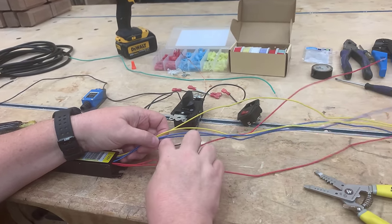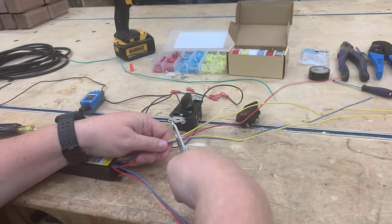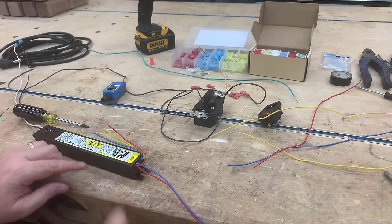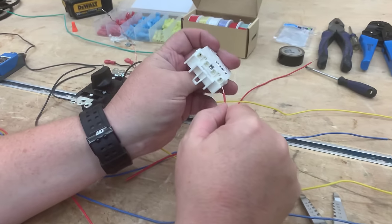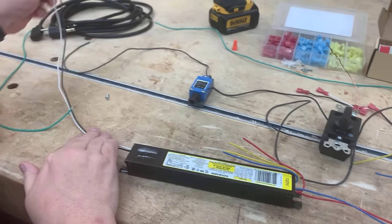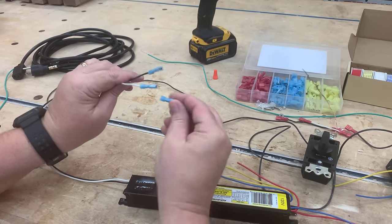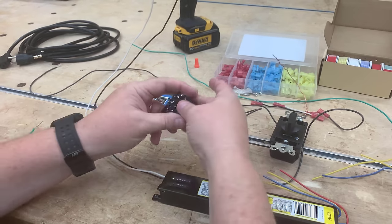Starting the wiring: on one side of the ballast, pull off one red wire and one blue wire — those are the two needed to send power into the lamp. The other four wires are for other connection types; clip and fold those back, and put wire nuts on them later. The red wire goes into either outer connection of the 2G11 socket, and the blue wire goes into the opposite outer connection. Strip the wire about a quarter inch and plug in. On the other end, attach quick connects using the crimping tool.